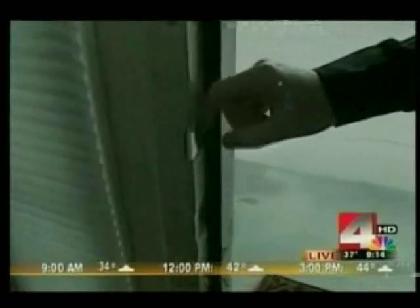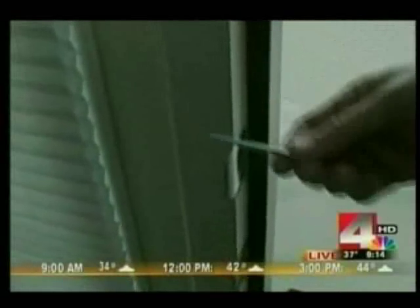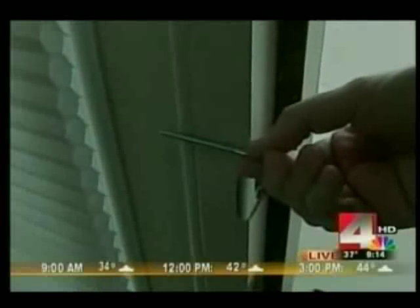Let's go over to the door here. This is your striker plate area right here. That's what you want to reinforce to let the actual lock work a little bit better. As you can see, this screw is going to go through basically your trim. If we use one of these longer screws, we're going to go past the trim and grab hold of the actual frame, and that's going to give the door locks an opportunity to work much better.